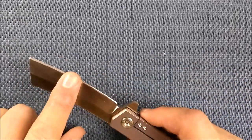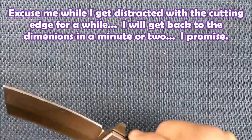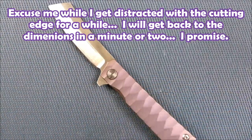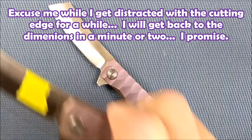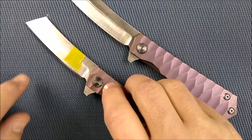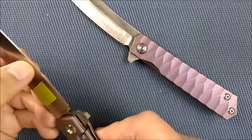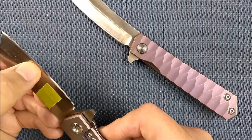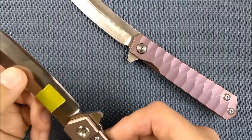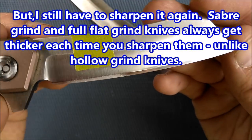I have sharpened this thing several times doing so many different cut tests. You might be able to see it has a convex grind. Now let me show you a surprise of the day — I've got a second one. This one has just a regular 20 degree grind on either side, at about 0.67–0.68 millimeters behind the grind.